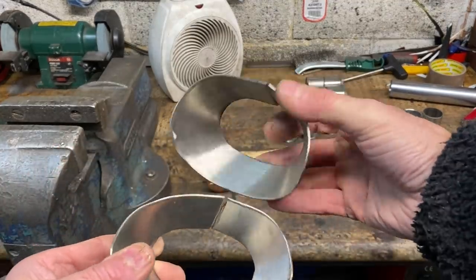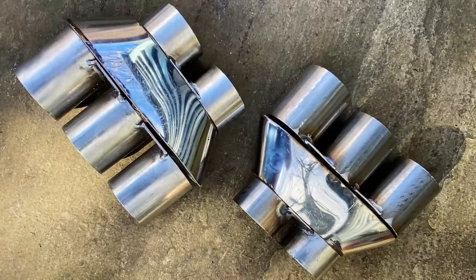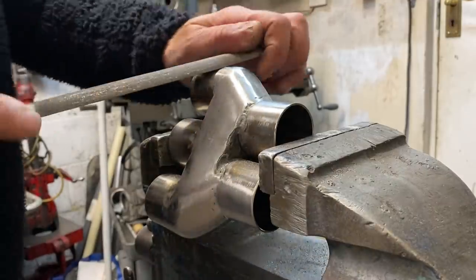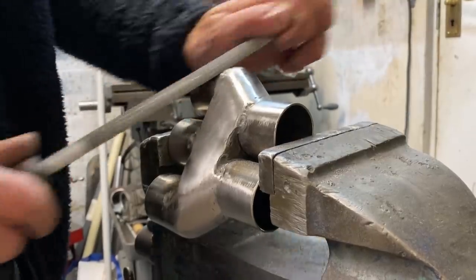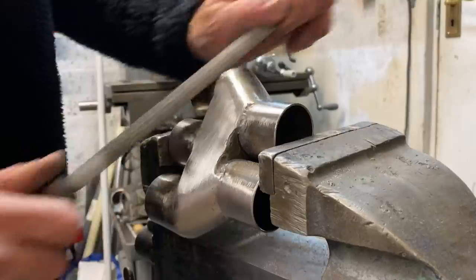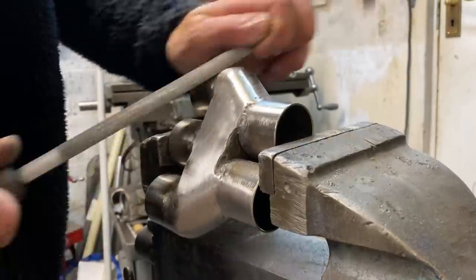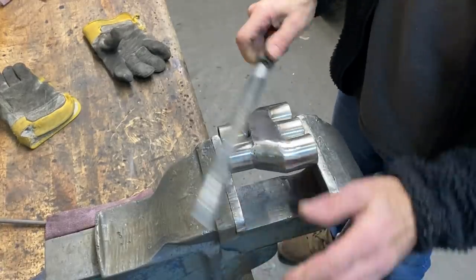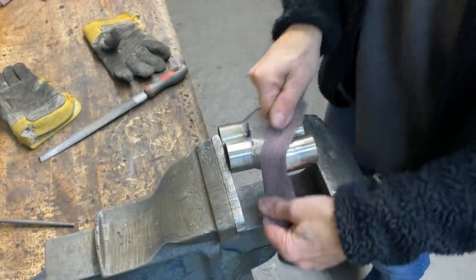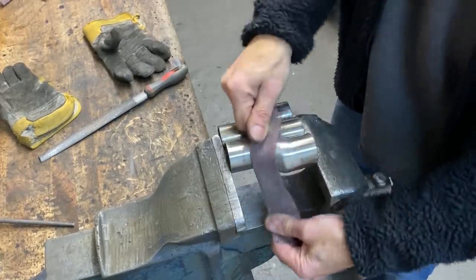With both parts shaped, I gradually trim them back so they fit perfectly, ready for welding. With both collector boxes welded together, I put them back in my vice and start filing up all the edges to make them nice and smooth. Because they're going to be visible from the side of the bike I want them to look just perfect. I finish off with some abrasive cloth — this amazing stuff cuts really well and doesn't clog up.